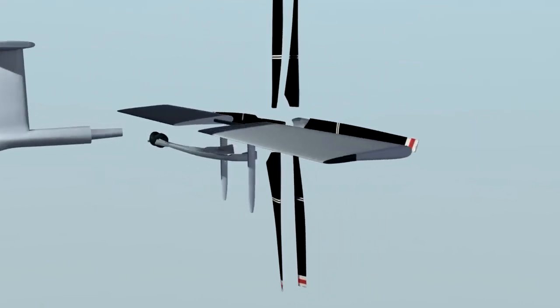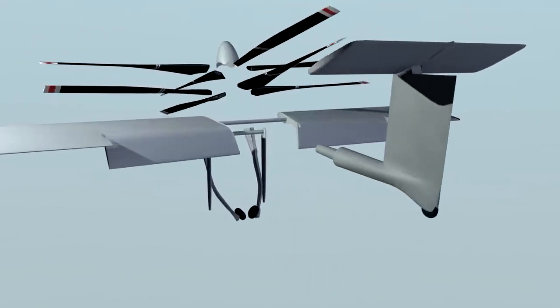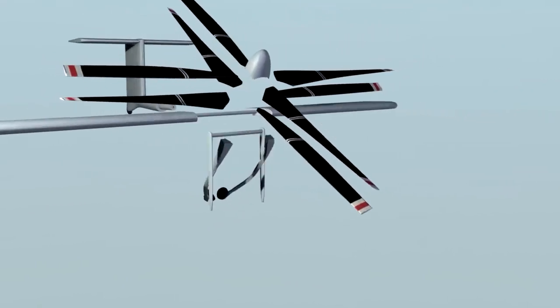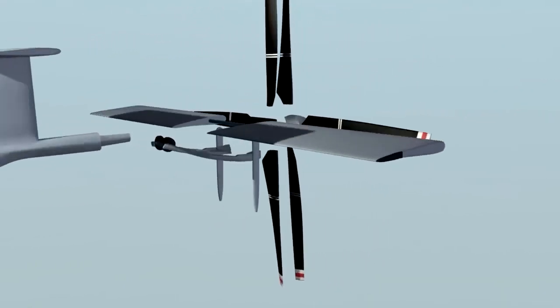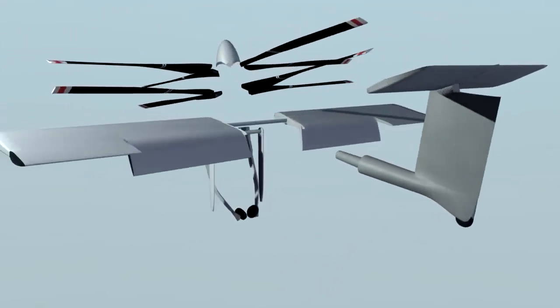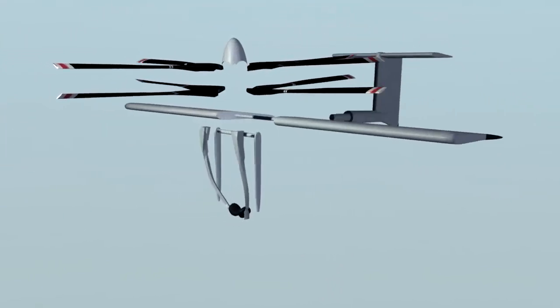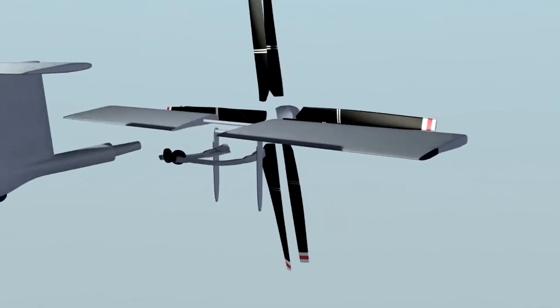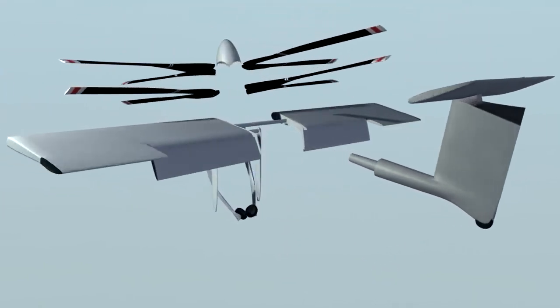The fixed wing and horizontal tail areas have been sized and their weights are estimated assuming conventional composite buildup techniques. The stabilator is hinged to the top of the vertical fin. Rotor blade design, including material selection, composite layup, and manufacturing process, have been specified. The blades have been analyzed for all loads and flight conditions.